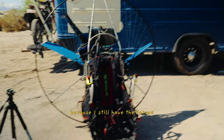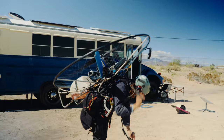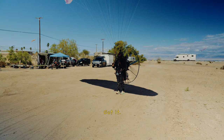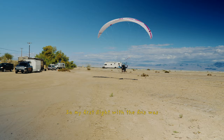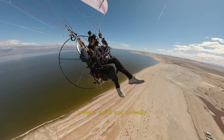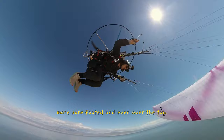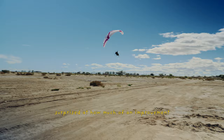He said only two fins because I still have the torque compensation on the bars. He said it's going to be like night and day difference. My first flight with the fins was honestly pretty impromptu and my GoPro decided it wasn't going to record voiceover. I was immediately impressed at how much better these things compensated for torque. Here I am at full throttle doing some weight shifts and actually turning against the torque to the right. I also did some wing overs and noticed that it felt a lot more sure-footed and even over the top.